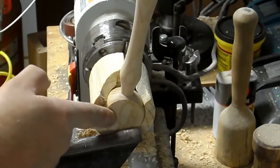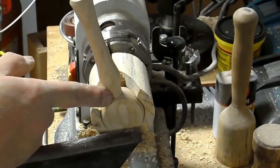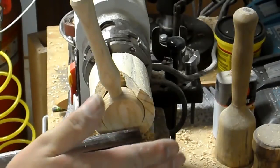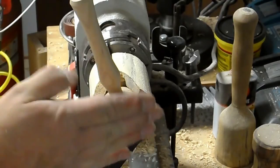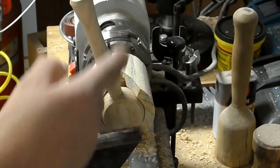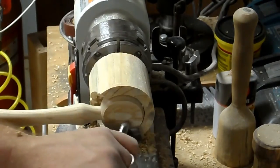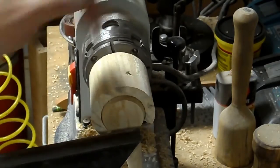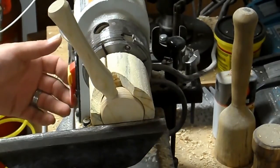There's going to be a little lip right around the edge of the bowl, and I want to get it almost flush with the front face of the handle. I've got the tool rest angled away and kind of turned so that I can rest my arm on it to control the tool and know that I'm out of the way of the spinning handle. Alright, that looks good — now I'm going to start hollowing out.